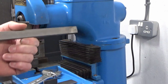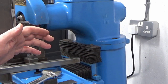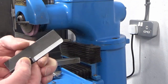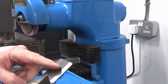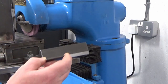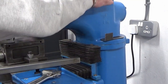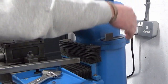So I've been giving it some more thought, and a couple of the guys had given me some feedback, and I've come back out and looked at it again based on that feedback. They'd suggested, why don't I try and fix something from where the head casting screws on. So I've removed just this side of the head casting bolt for now, and I've knocked up this bit of angle iron. I've cut this to length, cut this section out, and milled this so that it's flush with the rest of the angle iron, so there's no step there at all. So plan B, I don't know what letter we're going to get up to, but certainly plan B is to drill that out. That will sit on there, we'll drill that out so that the head casting bolt will go back through that. Don't need a longer bolt, there's plenty of thread. There was probably 3 or 4 mil of the thread sticking out the underside of the casting, so I'm still going to have full engagement of thread in the casting, so that's fine.